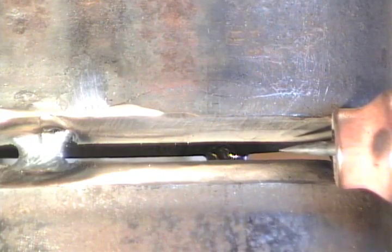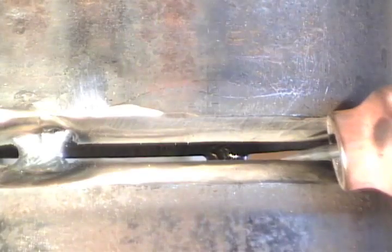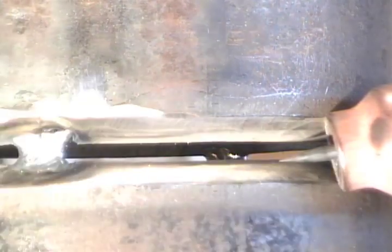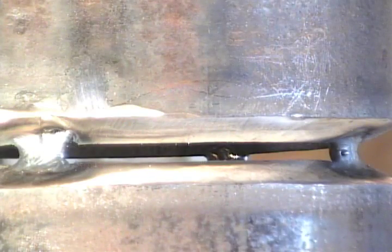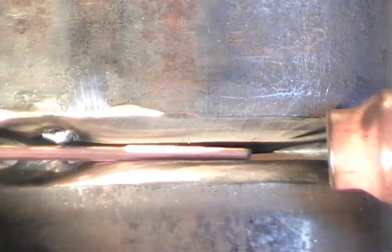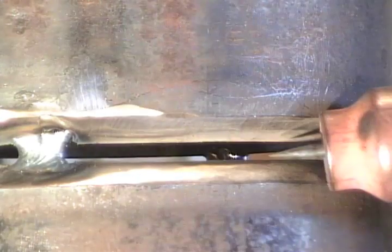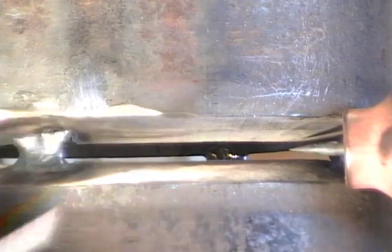And when you're ready, take a little break. One thing to be careful with, though: if you begin to heat the surface without filler going in and it's too close to keep the arc going, you could implant porosity and begin to burn the surface with no filler metal. Without the rod in there breaking the turbulence as a wind block, the gas starts pushing the air inside your pipe in a circular pattern — it creates a vortex and a circular swirl. You can actually see the surface begin to pop and bubble, causing imperfections in your parent metal. But that is a trick you can do.